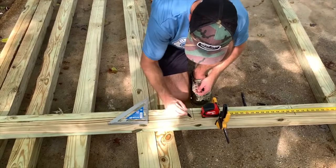And I was holding the camera while I applied that adhesive, so give me a break on how messy it was. But now I'm taking the panel and I'm gonna put it in place and push it up so that it contacts the half inch overhang that we have on all four sides of the window. As you can see, I'm pushing with a little bit of pressure to make sure that that acrylic panel is fully set and pushed against the adhesive.